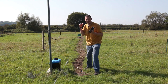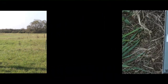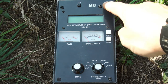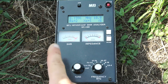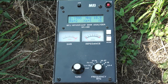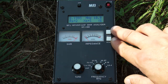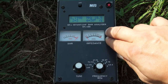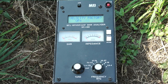Let me bring the camera in close so you can see what I'm doing with the MFJ. We're out in the sun so it's a bit difficult to see the screen. The other way you can test the cable is to put a dummy load on the other end and test the SWR — you should get down to 1.1:1 or something like that. But the method I'm going to use is to put it into advanced mode 2, so I need to press both white buttons together.